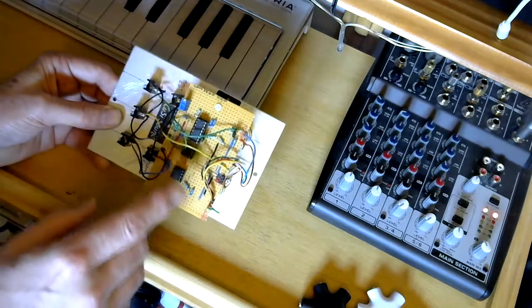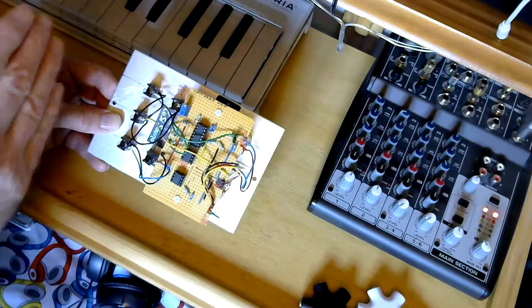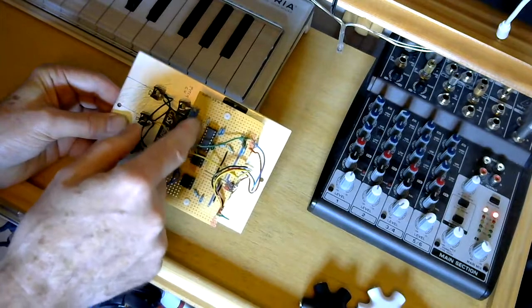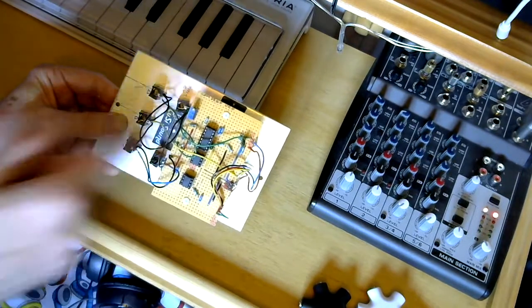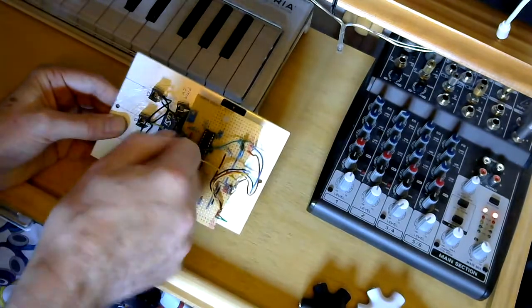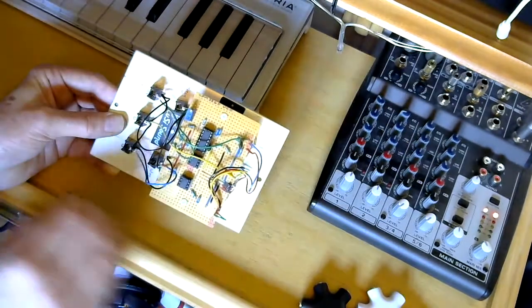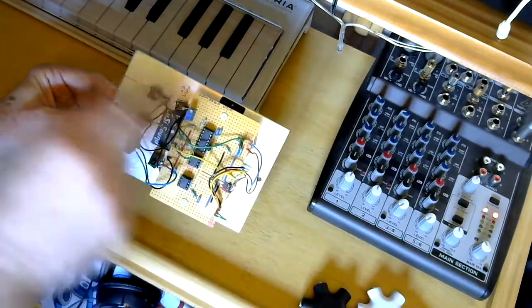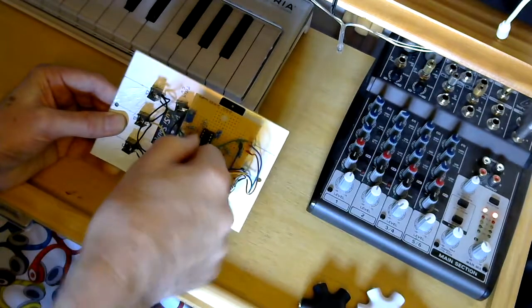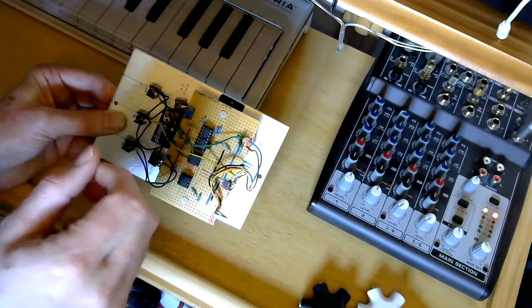The other control that you need when you are tuning one of these circuits is, not only do you need to set the pitch with the coarse control on the back, but on the original design there was just a bog standard preset potentiometer, and I was twiddling away for quite a while. What this does is set the tracking across the voltage ranges, so as you go across each octave it will stay in tune. I was struggling a little bit with setting it with the basic preset pot, so what I did, I used a multi-turn pot to give me a little bit more fine adjustment.